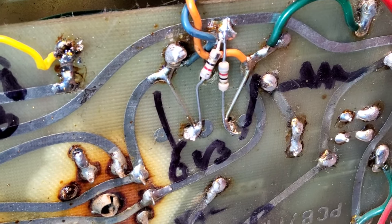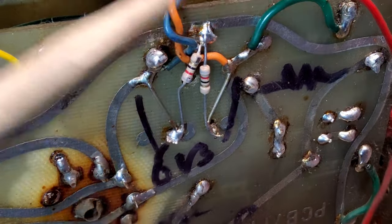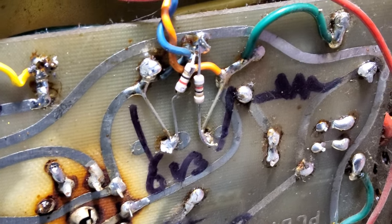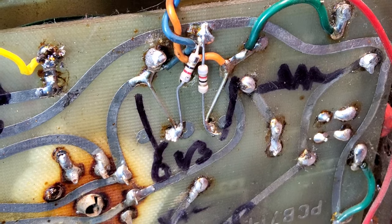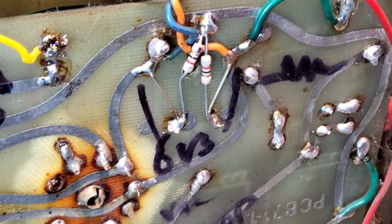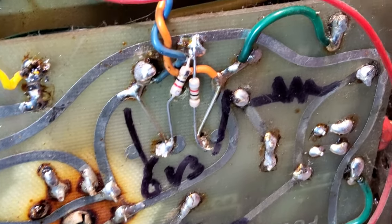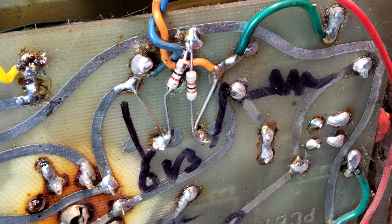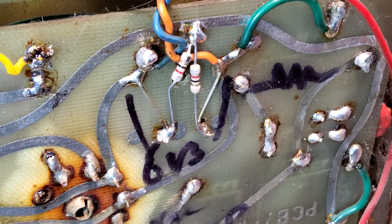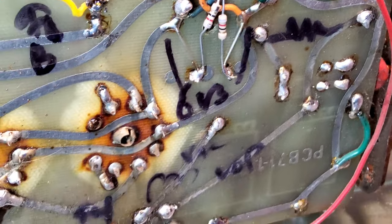What's that there? That's some kind of virtual center tap. Those wires are for the filaments - they're certainly the same color. Now, what value are those resistors? They actually look quite big on camera but they're an eighth of a watt - those really tiny ones. That's something like 82 ohms, something around there - we'll have to put the meter on. Can't really make out the colors and I can't see them very well. We need a magnifying glass with my eyes to see those properly.